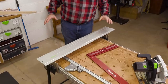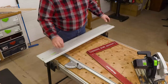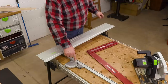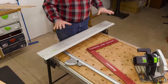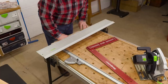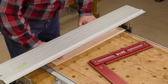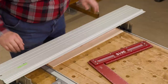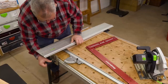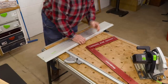To do this, when you adjust it you're going to adjust it to the thickness of your stock. But we're also trying to work to our fence. So I want it fairly low to the table, but I don't want it to sag or droop. I've got a couple of pieces of scrap stock here that are just exactly the same thickness as my fence. So we're going to drop those in and then lower both sides down until it's flat, then lock it.